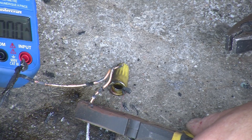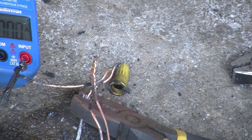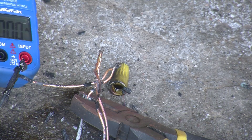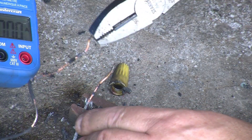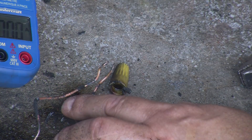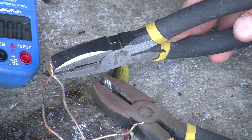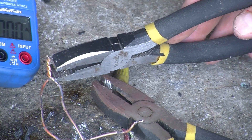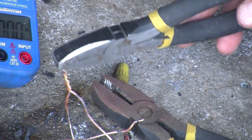I would say this connector did not do nearly as well as the twisted one. In the end, the connection that was twisted is almost as good as before the destructive test. Whereas this one, the wires are clearly singed. It certainly has shown that twisting the wires together before using a wire nut or MAR connector is the thing to do — it produces a very good, amazingly good connection.